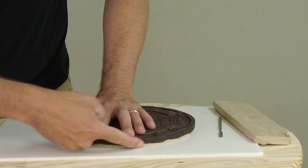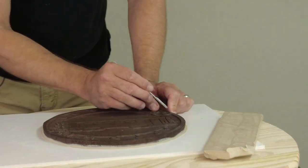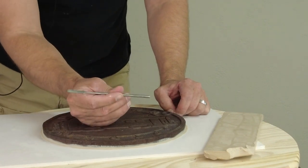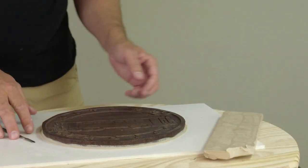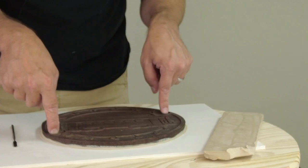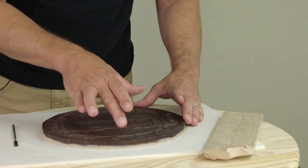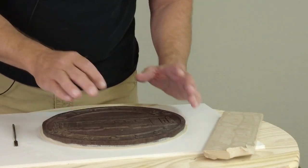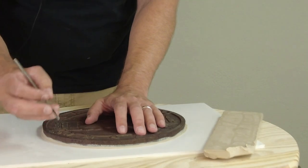That softness is really helpful to work into areas like this. I took a little ball of clay and poked it down into the bolt holes with a dental tool handle, then used the other end to scrape it flush. That way the silicone still captures the detail of the two little screw holes, but I don't have to worry about silicone going underneath the pattern. If silicone flows under there, it can release air bubbles up into the surface of the mold.